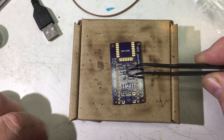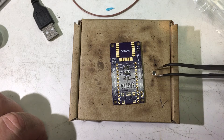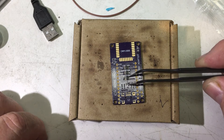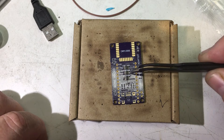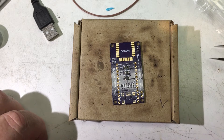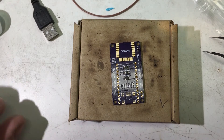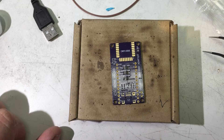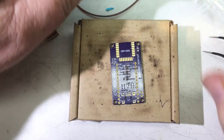You don't have to be too precise about placement because the solder itself will tend to suck the part into position. I'll usually use a magnifying glass when I'm all done and go back and tweak anything into position. Next, I'll put on some of the capacitors — they also come in little strips like this.